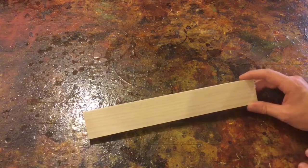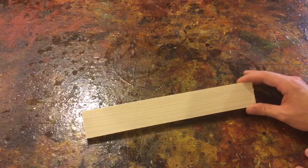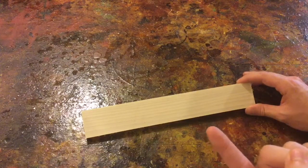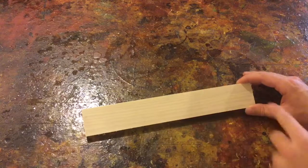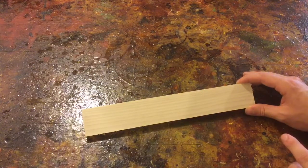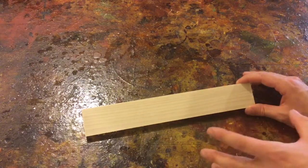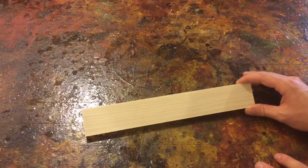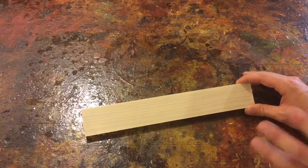When you do the surface preparation, we're looking for two things: one, your project should be completely smooth to the touch, and two, there shouldn't be any pencil lines left over. If pencil lines are still there, when you go to stain your project it's not going to go away — it's actually going to get worse and show up like a highlighter, or stick out like a sore thumb.